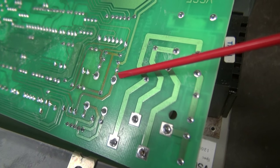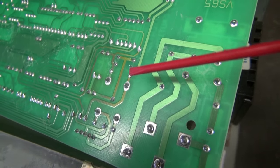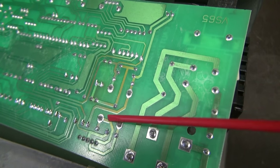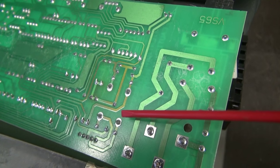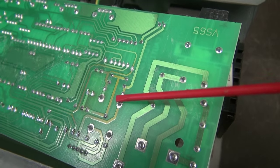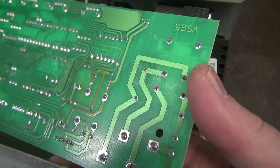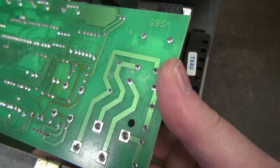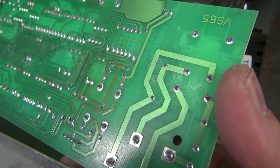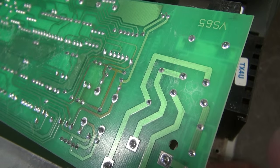In this area right here is where those resistors are. If you look, you'll see that these foils are slightly discolored. The reason is the leads here cracked — it's been generating heat because of arcing. If I get underneath here and move them, you can see the leads are flopping around. So let's get these soldered up.